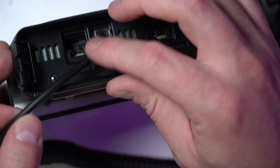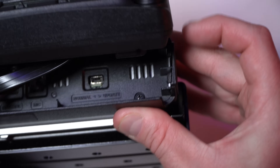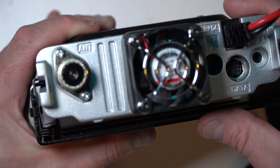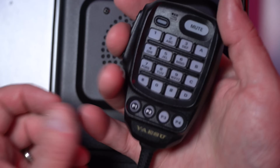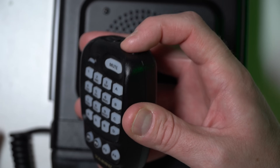To route the microphone cable you push it into this little slot here, then come in with your head unit, click that into place, seat it on this side, rock it into place, and now you're locked in. On the backside — there's that data port I'm excited to see. There is an external speaker port as well as your coax connection for the antenna. This is a pretty slick DTMF mic — you can key in DTMF tones for repeaters. There is a mute button, which I like, and up and down rockers for sliding through memory channels or frequencies.